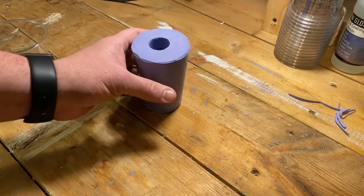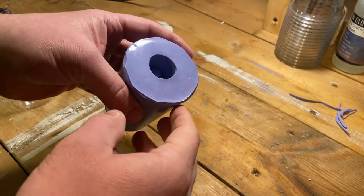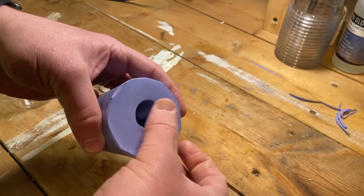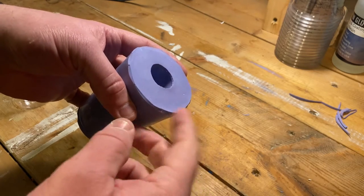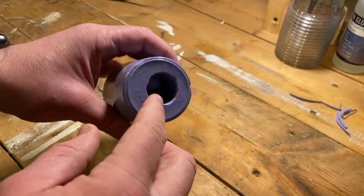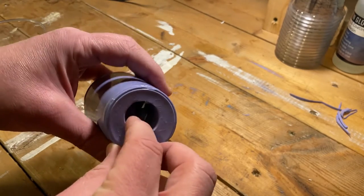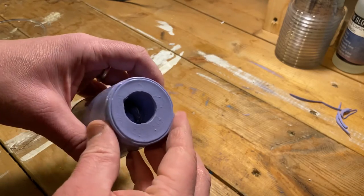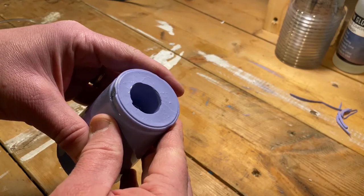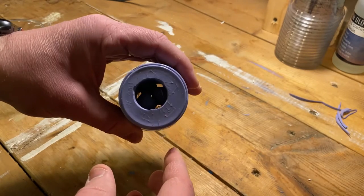Now that we have this mold we have to do something with it. I took a utility knife and trimmed out the edges of the mold — it was a little frayed with some silicone and some floppy edges that just didn't look nice and neat. Same thing on the bottom — trimmed that away so we have a nice neat bottom. I figure it's better to be a little flared than the opposite, because you want it to be too large and have to sand it down rather than the other way around. Now you can see all the way through and see the valve parts.